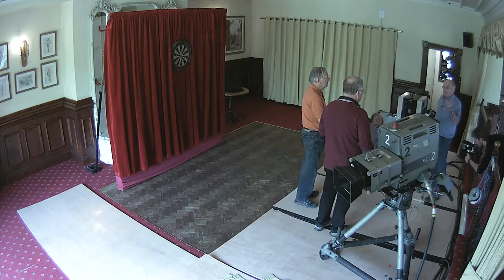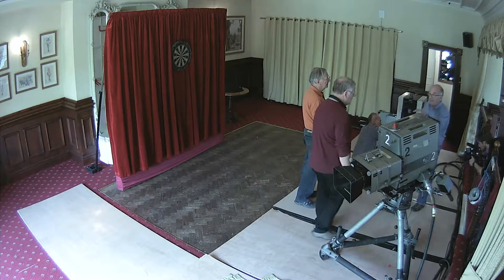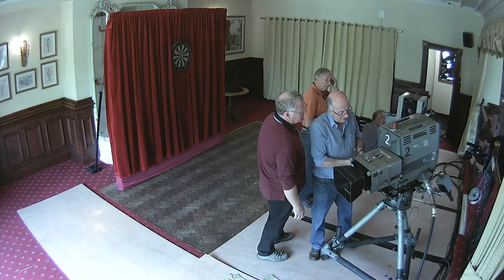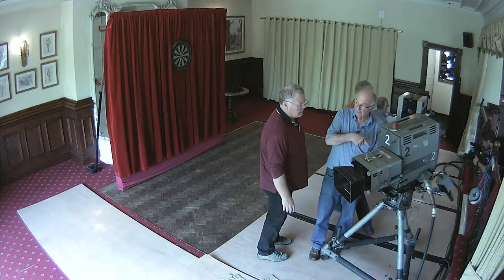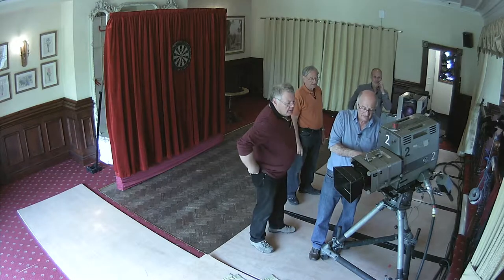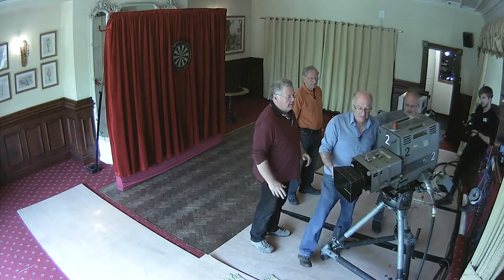No, but both shot boxes have got exactly the same fault. So would that be a pin in the plug somewhere? I would have thought, because we've changed the wires as well. I know. So it could be a pin on the lens body. Well, I think the shot box actually though determined. No, but we changed both of those. We changed both of these leads too, didn't we? Yeah, we've changed all the leads, and both zoom demands that we got have got exactly the same problem. So it sort of points at that. It does. But let's let it warm up and dry, or whatever it does with itself.